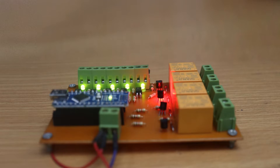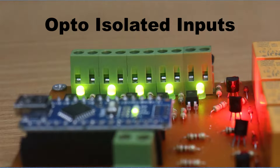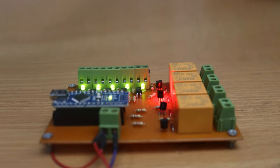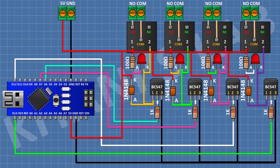So this is my Arduino mini PLC. It has five opto-isolated inputs, which are Arduino pins D2, D3, D4, D5, and D6. And it has four relay outputs, which are Arduino pins D7, D8, D11, and D12.